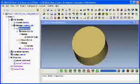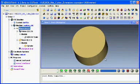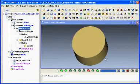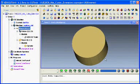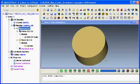The demonstration is to show how we've enhanced minimum cutter extension. In the past it has worked against the stock component with the tool being too short. What we've now done is added the ability to check if the tool is too long, and we also check against the fixture component as well as the stock component.